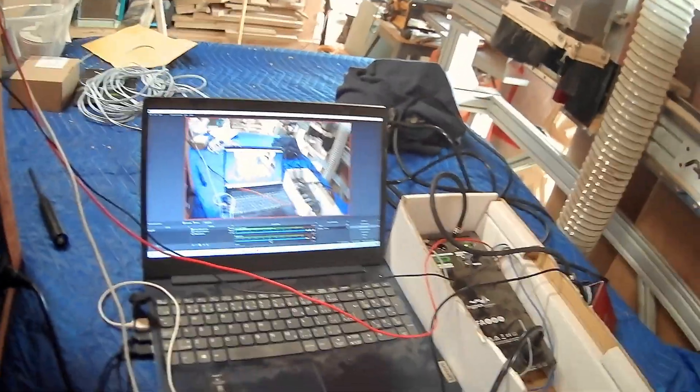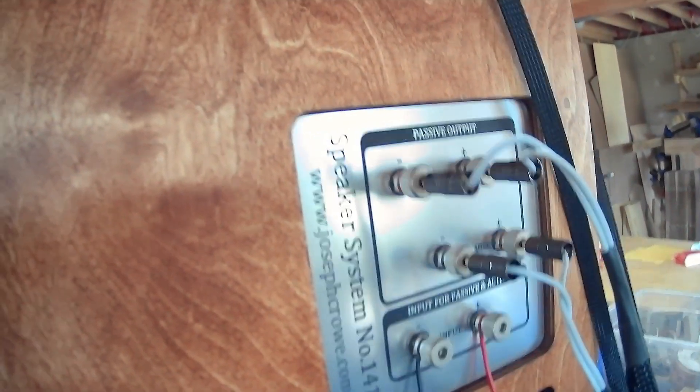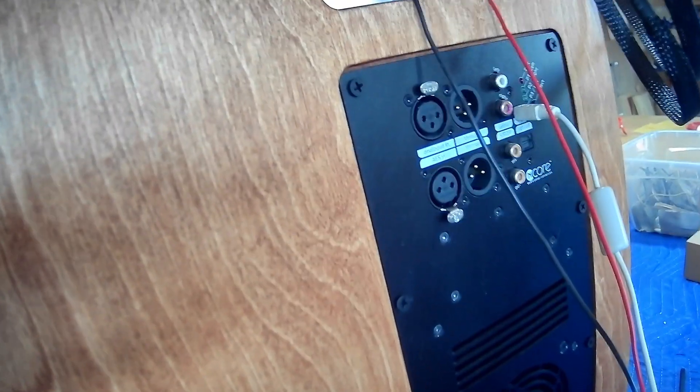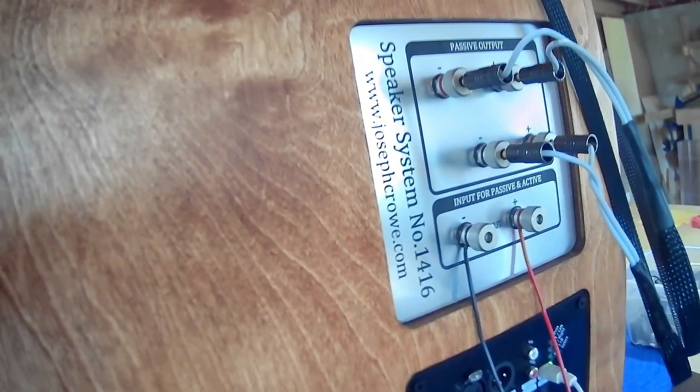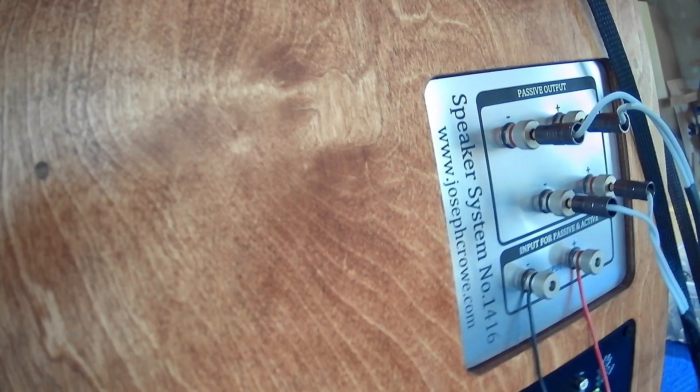With the 98 dB sensitivity you're able to play at very high SPL levels with even a low-power tube amp. So what I'm going to do now is take my microphone — which is what you've been listening to — and place it in my mic holder, which is positioned on-axis with the speaker. It'll allow you to hear the sound of the speaker in either configuration. For right now we're starting in the passive mode, so you're going to hear the internal passive crossover and how it sounds. What I've done is matched the frequency response with the DSP — with parametric EQ settings — it has an identical frequency response and level to the passive version, so you should only be able to hear the difference between passive and active since I've matched everything else to the best of my ability.